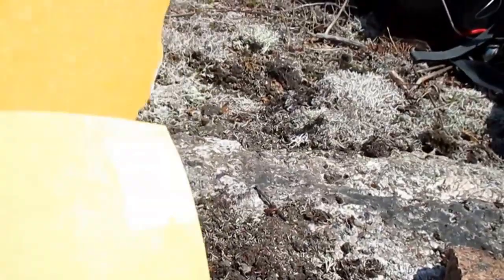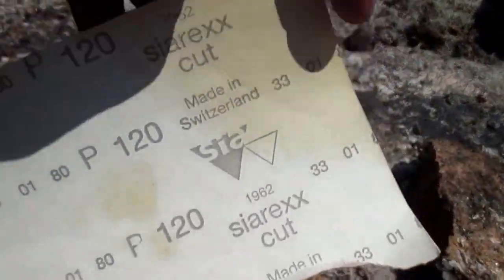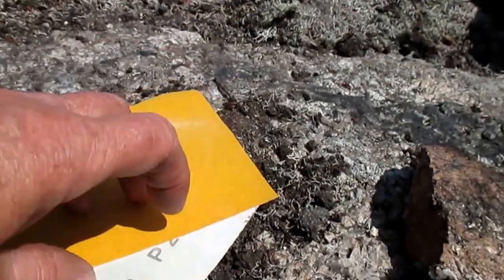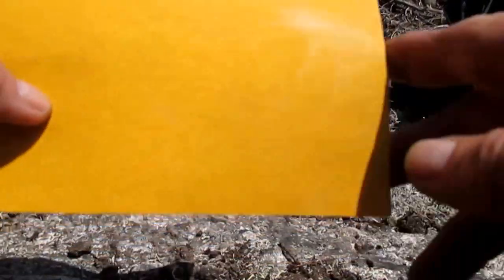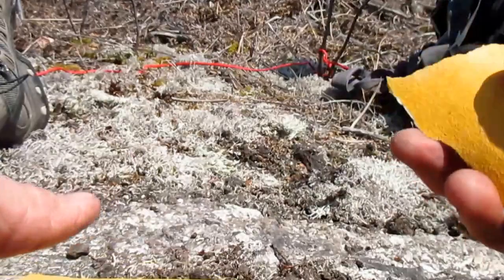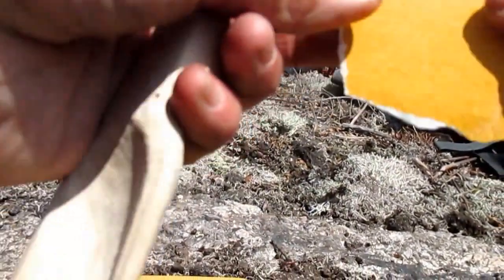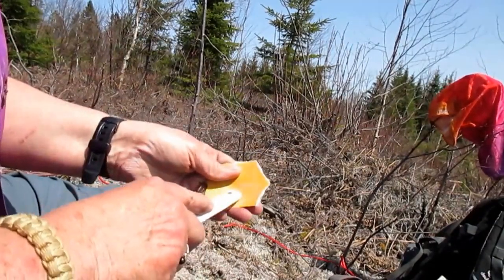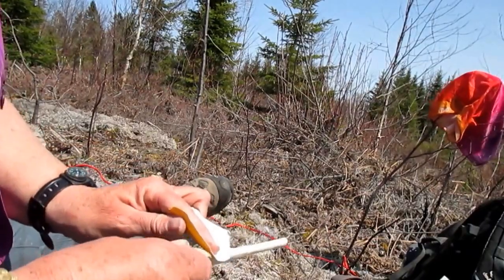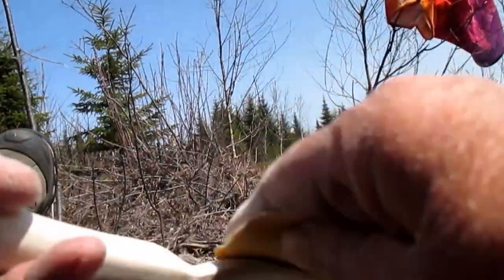It digs very well. I'm now at the sanding stage. Maple is a hard wood, so I'll start with a coarse 120 grit. If I had softer wood, I could use 160-180. I'll finish with 280 to soften perfectly before oiling. I avoid taking a piece with intact sides because there's a risk of marking the wood. I prefer to tear it by hand and take a small enough piece that can get into the hollow of the curve by pushing with a finger. But I start with the handle to soften the paper a little. It's important to sand along the grain of the wood to avoid making marks that would be difficult to remove.